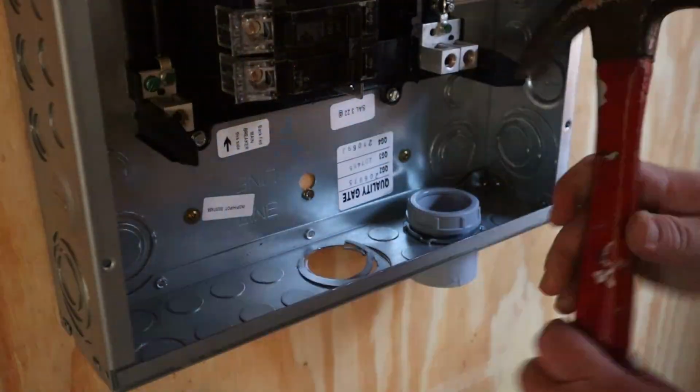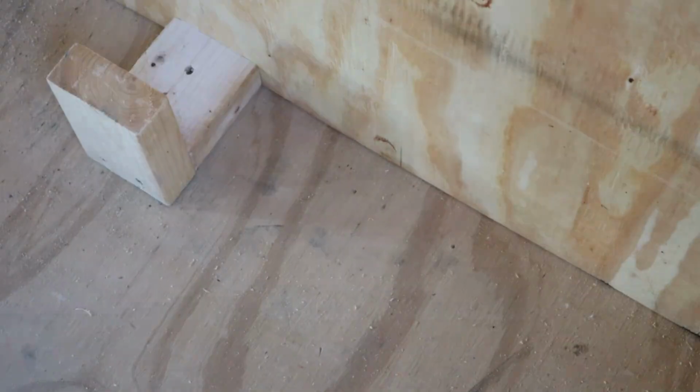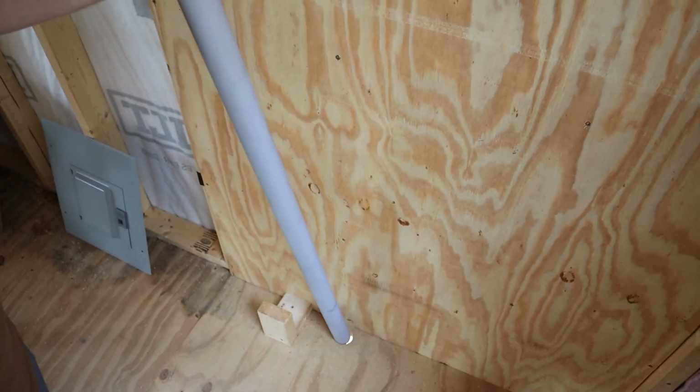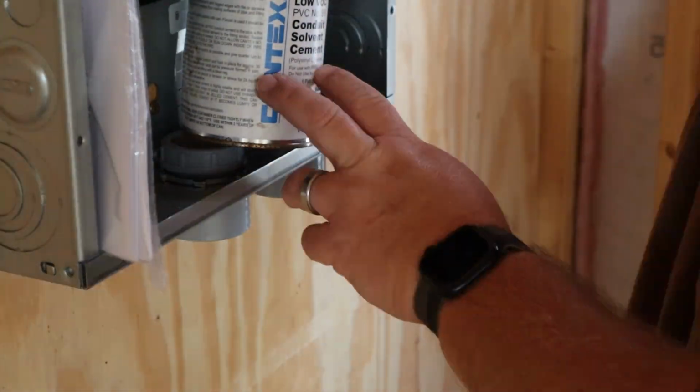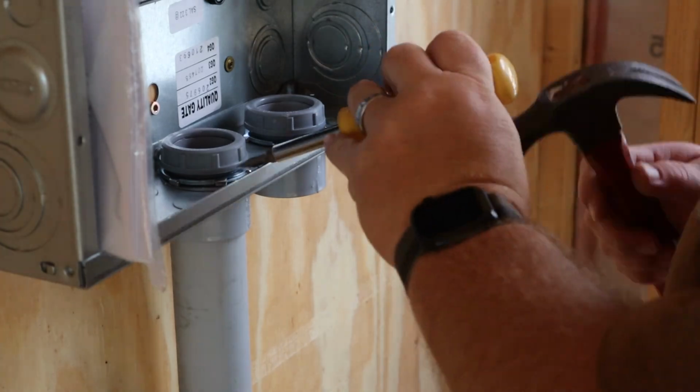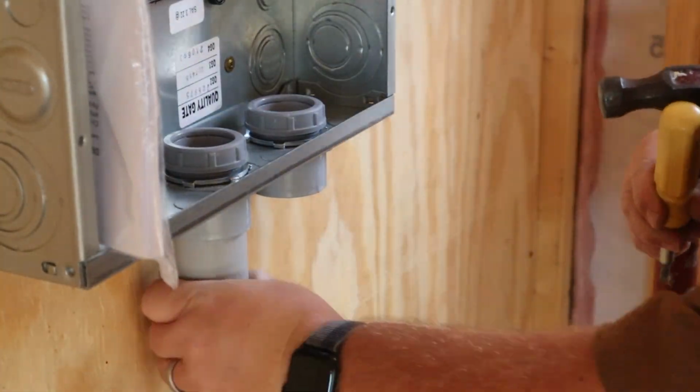The first thing for me to do was to get my sub panel ready. I needed to insulate the wall, put a wall covering on it, and then mount my sub panel box to the wall, attaching it into the wall studs. I also decided to mount this externally to my walls. I like this kind of application for a workshop setup. It allows much easier add-ons, configurations, changing things around, plus make sure my wall behind my panel is fully insulated.